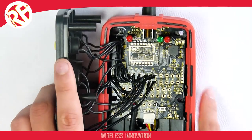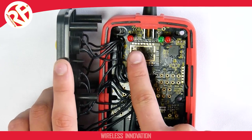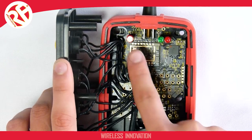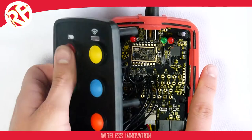Say I wish to now operate in LoRa mode 2 — we repeat the steps. Push the set button once then wait; we're now in menu 1. I push the set button three times, waiting for my three LED flashes. We wait for the module to drop out of config mode and we're now operating in LoRa mode 2.